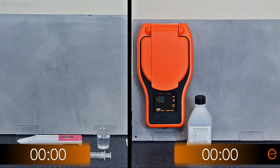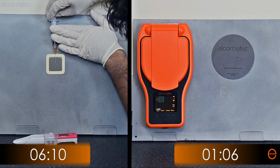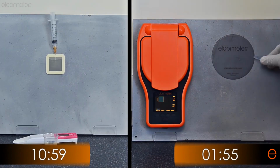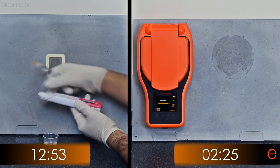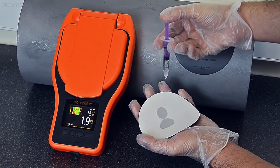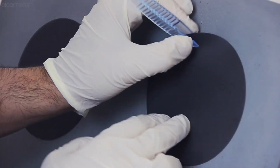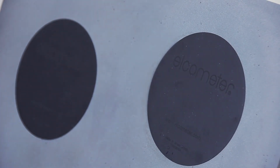When you consider that ISO recommends that a Bresle test should take 10 minutes, the Elcometer 130 SSP significantly reduces the inspection time required, increasing productivity and saving you money. Furthermore, as each filter paper remains on the surface for 2 minutes, you can prepare multiple tests which can run at the same time, reducing inspection times further, especially on large surface areas.